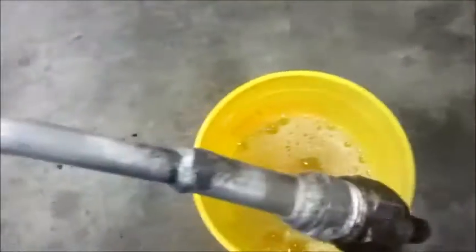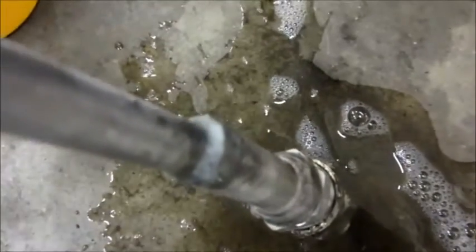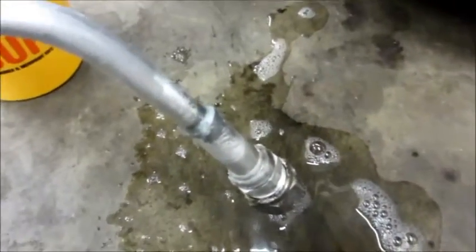Now for the test. I've got 100 pounds of air on the tube and I've got it capped. I'm not so sure that this cap here is going to hold, so I'm going to dip it in some soapy water and see if I see any bubbles. Looks pretty good to me. The end of that cap fitting is leaking, but that is not what I'm worried about. I don't see any leaking coming from the braze joint, so I guess it's good enough. I just need to work on my plug cap.